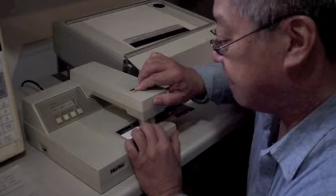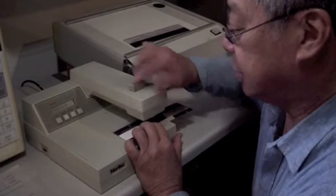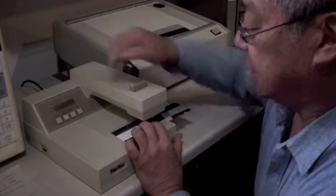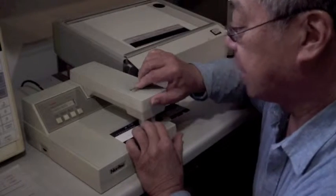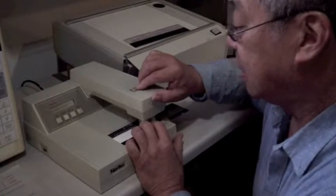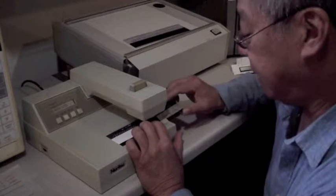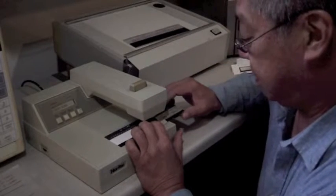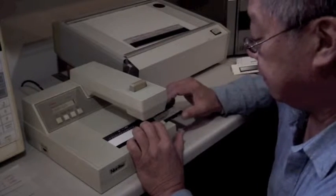This is the fourth step, 0.24. The fifth step measures 0.38. Six. The sixth step measures 0.56. Seventh step, 0.82. Eighth step, 1.15. Ninth, 1.55. Tenth, 2.01. This is the 11th step, gives me 2.21.